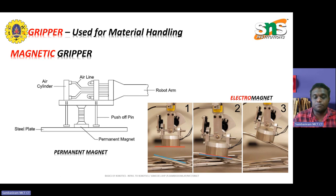Although magnetic arm grippers have handled a wide range of potential applications, there are pros and cons to using them in various industries. It may cause more pieces to become magnetized after being handled by a magnetic arm gripper. Even if you manage to pull the gripper away, the newly magnetized piece may attach itself to another piece of material. One drawback is that they can only handle ferromagnetic materials rather than other types of materials.